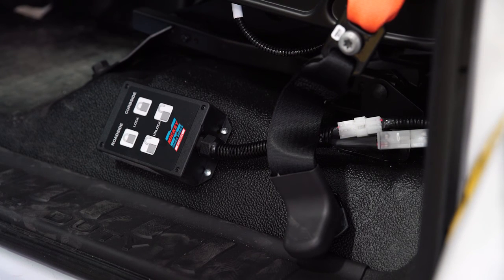If a fault error occurs, there is something preventing the locking flap from reaching its final position. The most common things to check are that the doors are closed all the way down the entire length of that side of the body. If all the doors are closed, check to make sure there are no obstructions in the way of any moving parts in the entire locking assembly.